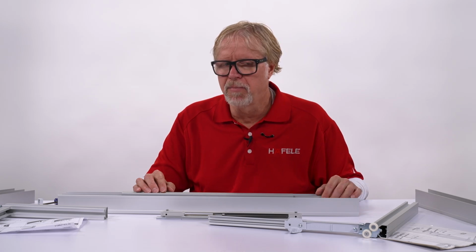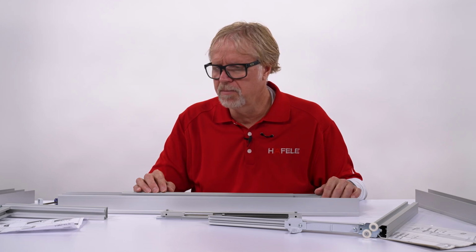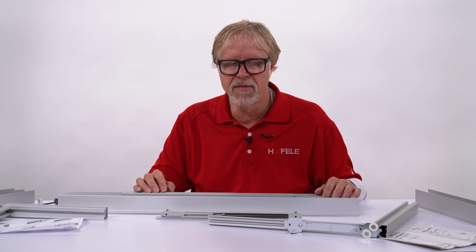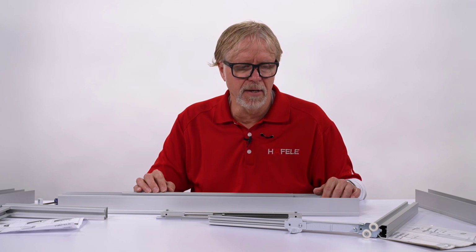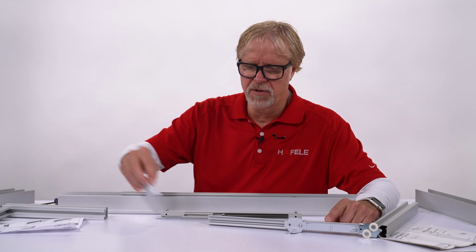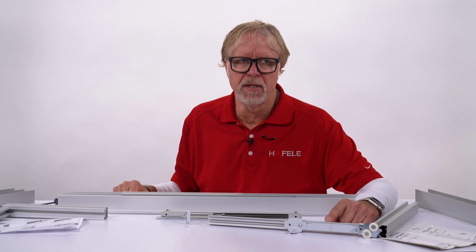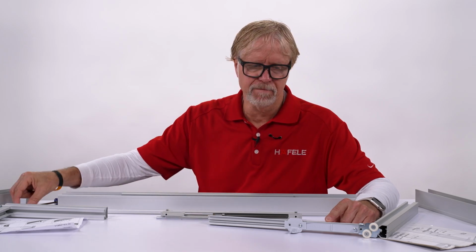So those are the primary differences in the new soft closers for Aluflex. New system compared to the old. You do not make adjustments to the trigger height by trimming. You will not need to do that with the new system. You do not make any adjustments to the location of the trigger in the upper door, and it's no longer held with just that single set screw that oftentimes customers would have moved based on the speed of the door hitting that trigger. So this trigger will go away.